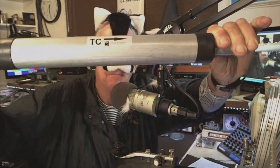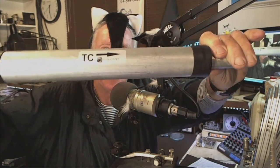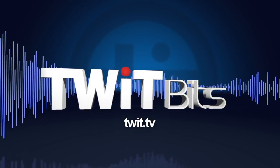So that's your lesson about antenna traps. Remember: the holes need to go down. The outside sleeve may or may not be terminated to both sides, but at least one side provides the capacitive reactance X sub C, and the internal is the coil. What went wrong with mine twice in a row on a three-year-old antenna was a bad connection at the coil — resolved by loosening things up, scrubbing, and making a new connection. No need for a new trap, and we're ready to go.